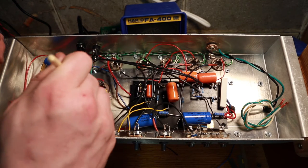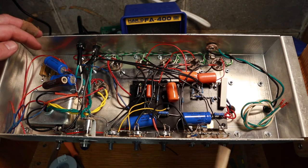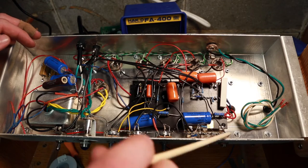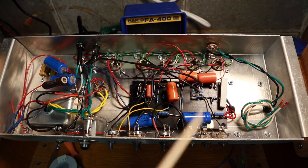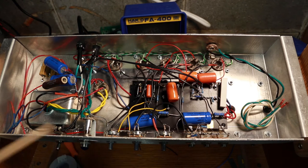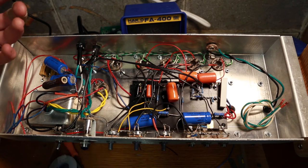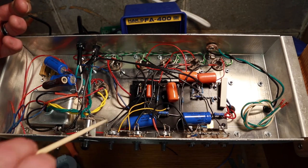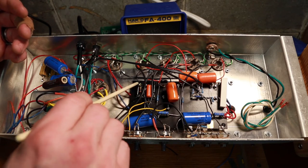It can carry a very large amount of current. I've got that tapped in right here at the transformer as well as my mains, so we're all coming to a single point right here. I can't call it a true single point because my inputs are grounded as well as the speaker and chassis, but the bulk of the current will go through this point down to here. A nice way to do a sanity check is to print out your layout, get a magic marker, and mark off each connection.